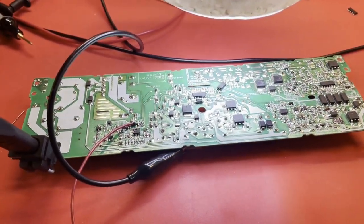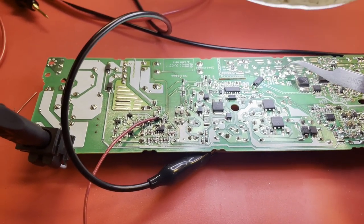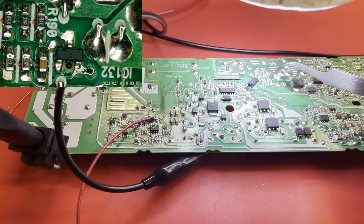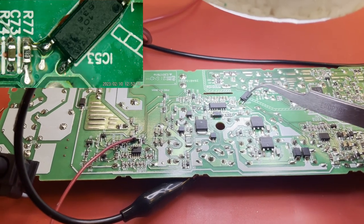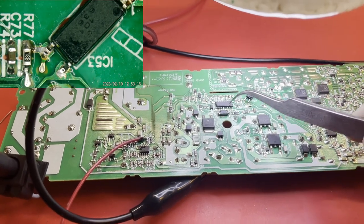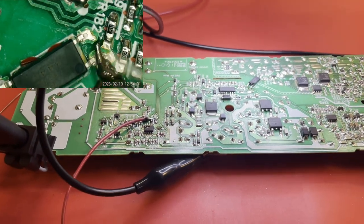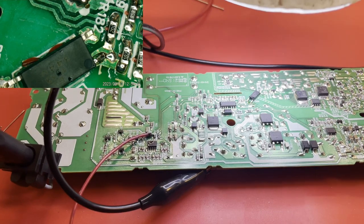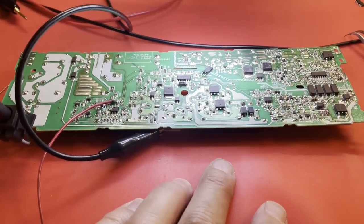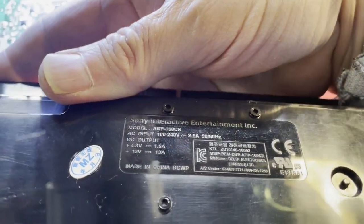Well, we're not much better off than we were. I went ahead and changed out this reference IC — I said it was a TL-431 but it's actually a TL-432. The difference is the arrangement of the pins — they're swapped around. I did change that out. Even though the opto-isolator checked fine, I changed it — I've got about 100 of them. No difference, she still shuts down. Of course I'd already changed the DDA001A chip earlier — the DDA001AG — which made no difference. So I've decided to look through my parts and try to find another supply identical to it for comparison. This is an ADP160CR, and I was able to find an identical working ADP160CR outside, so now we have another avenue to pursue with side-by-side measurements.